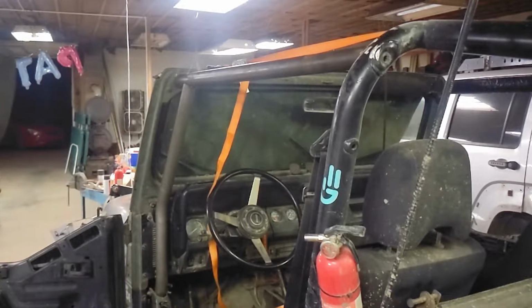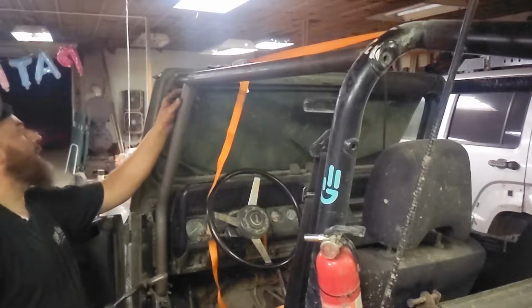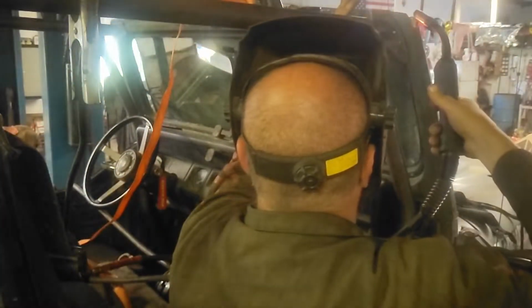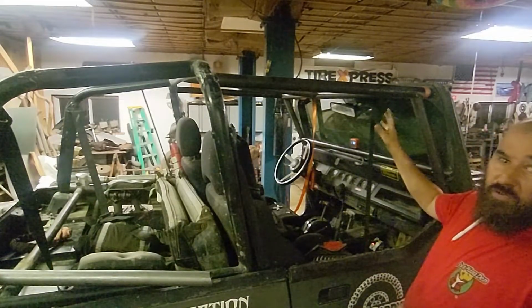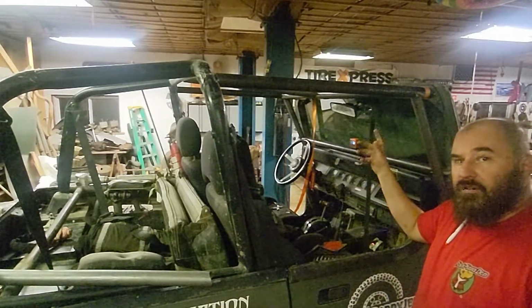Okay. First part of this cage is done. I mean, really, the instructions are pretty good. It's going together well. All the notches seem to be lined up. I don't have any big gaps. Put this dash bar in, that went in okay. Went to put this upper crossbar in, and it wasn't even close. It was really tight. Went ahead and measured and realized it was about 1/4 of an inch off.